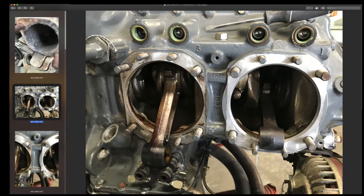There's a lot of carbon on the front of them that probably was getting a little old, and it's kind of leading me to believe that perhaps if I get a little bit of extra money, maybe I'll overhaul the other two cylinders as well, or at least open them up and clean the pistons, because it was looking pretty ugly.